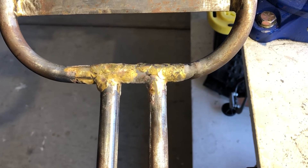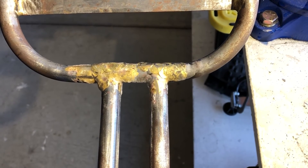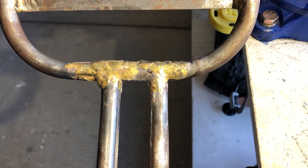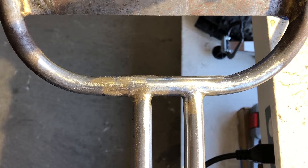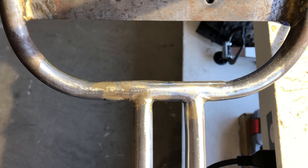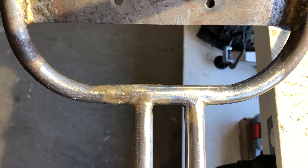Here it is after I removed the flux — I used water, a rag, and a hose. Now what I'm going to do is very carefully file it down, taking advantage of all that extra material there which will cover the cracks. That's all I'm going to do on this side. Note that this is the side where I made the crack repair — you can see all that extra material built up into sort of one continuous surface. That was done with hand files.